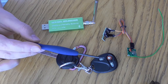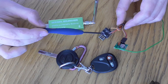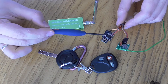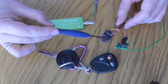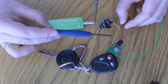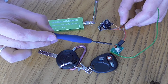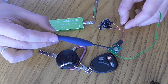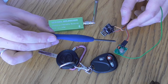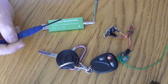I will be doing the cloning with my device, which was originally a radio jammer. It is composed of two parts: first is a Digispark Arduino device based on the ATtiny85, and the second part connected to it is a radio transmitter named FS1000A, which does simple ASK modulation.